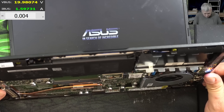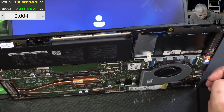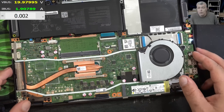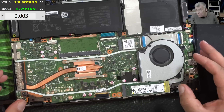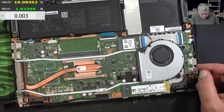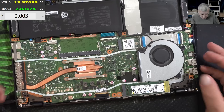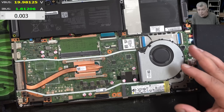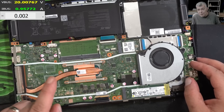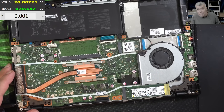A perfect job for a Monday! Now you know how to check everything. If you don't have liquid damage, start by checking the power button at the keyboard connector if the power button is on the keyboard. Then you have a few more power supplies to check to ground, to see if any are shorted to ground. And of course, disconnecting the battery and the BIOS battery. Okay, I'm going to stop now — thank you for watching, like and subscribe if you liked the video, and see you on the next one. Have a beautiful week, goodbye.